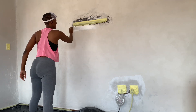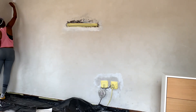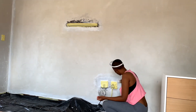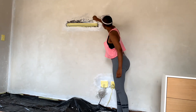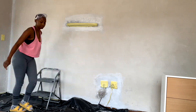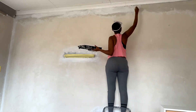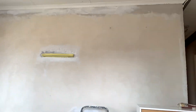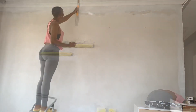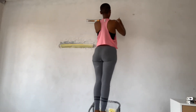Because the wall is raw, you need to prime it with plaster primer. I used the small brush to prime all the corners, creating a border with a small brush, and also prime all the little pieces that your roller can't get to. Then as soon as that's done, you can go in with your big fat roller. Primer done - I waited about three hours for the primer to dry before moving on.